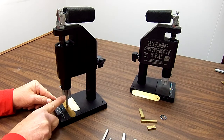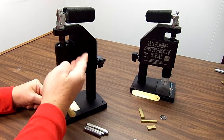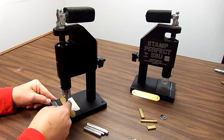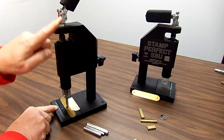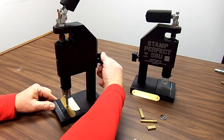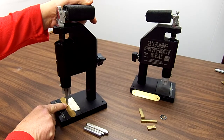To set up the correct marking height for the length of the stamp — and depending on whether it's a longer or shorter stamp, you can see the difference in the length of these — this will require that you move the head up and down according to their length. Once you put your hand stamp in and it's touching on the piece to be marked, we're going to raise the handle up to around 2 o'clock, which will bring the head up on the column, and then we tighten the column screw. Once that's tight, when I lower the handle, I've got the right marking distance.